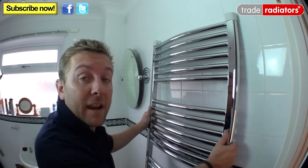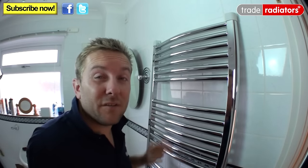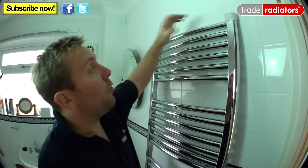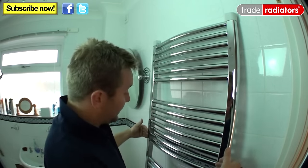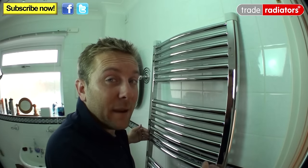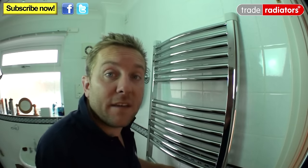This is a Ferroli radiator, which has a few advantages over other towel radiators. Mainly it has a 25mm bar instead of a 21mm bar, which means its heat output is much greater — it can heat the room and your towels. It's of Italian design, with one factory-fitted blank at the top and an air vent on one side, so there's only one joint to worry about. It's a curved towel rail but only comes out about 5mm more than a straight one, letting you tuck in more towels. Ferroli also offer a comprehensive 12-year guarantee.